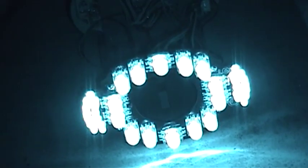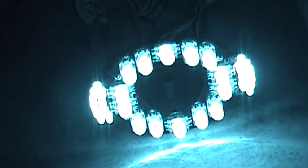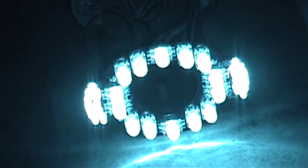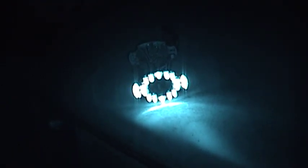Check that out — that's the illumination from that infrared device. If I turn around and look at that thing with night shot mode on, it's glowing like a house of fire. It actually glows brighter when run from a car battery, because it's probably pulling enough current from these alkaline batteries to drag down their voltage significantly, and therefore dropping their brightness as well. Last night when I was playing with this, it was so bright you couldn't even make out the individual LEDs through the camera's own viewfinder. But it certainly gives the night shot feature a much-needed boost.